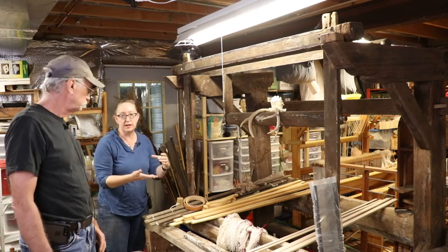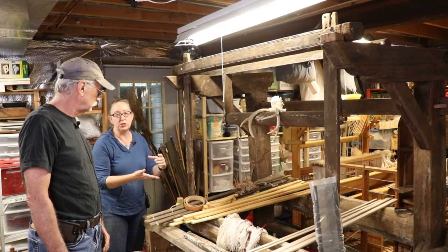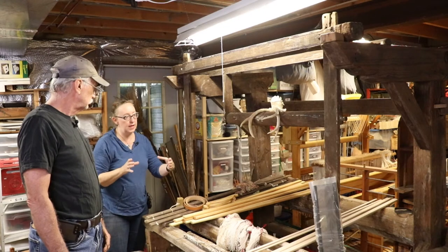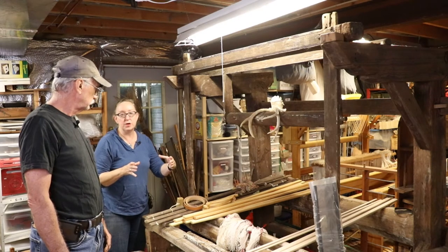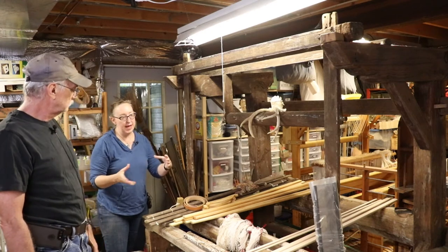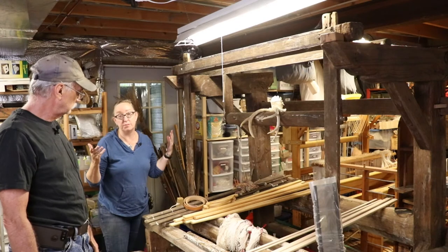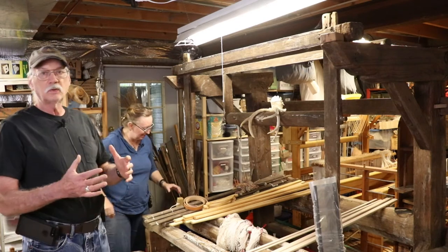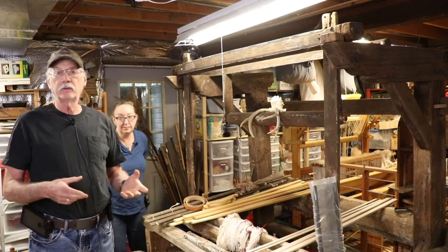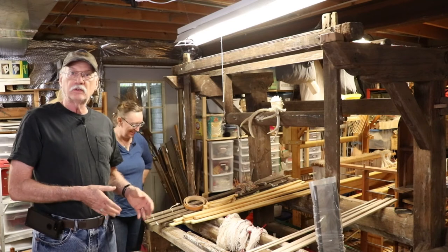And then we are going to put a pressure-treated lumber pad under them, bring the loom up to level, and then put a frame around each leg holding that pad in place to keep that pad from shifting out from under the leg. And anyway, the loom's going to have boots. And we'll take the verticals for those boots, and we'll do some edge treatment on them on the router or the table saw. Make it pretty. Miter joints, so they look nice.